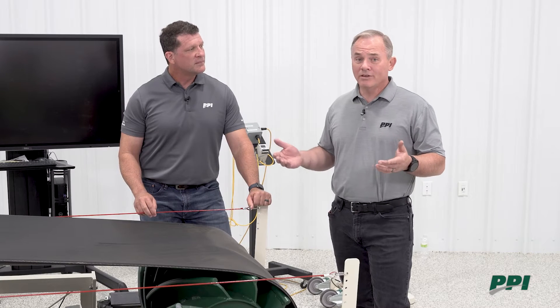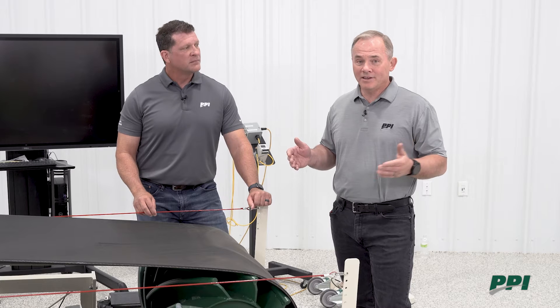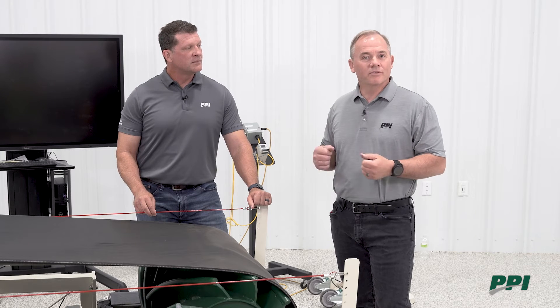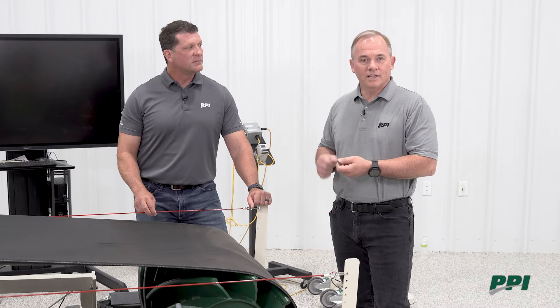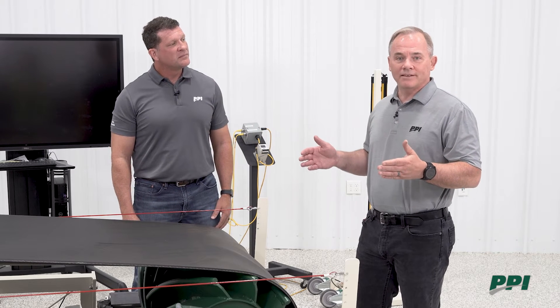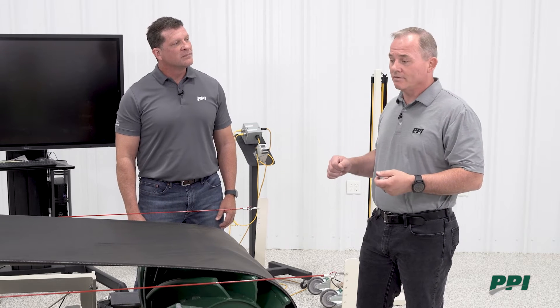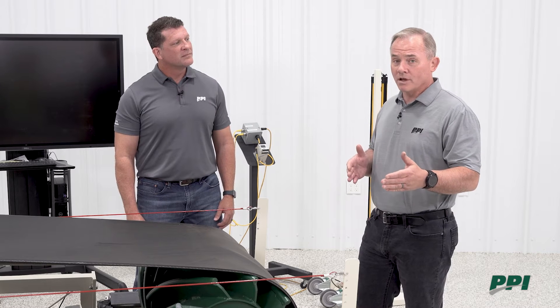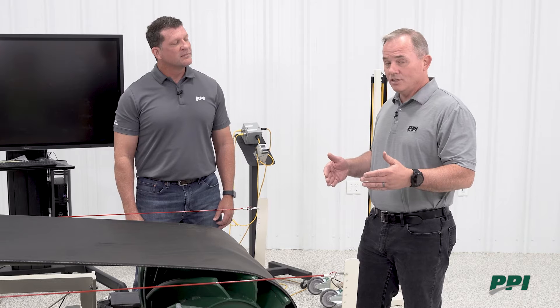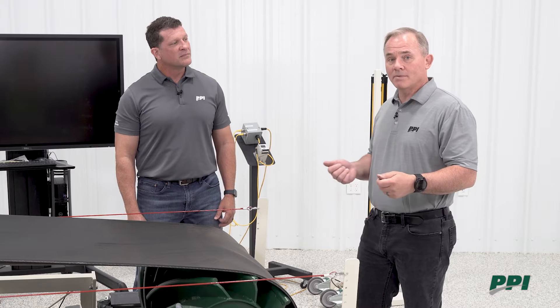One is it's easy to do. Compared to other methods of belt tracking, it's very convenient to just come around to the back of the pulley, grab your wrench, throw it on the screws, and do some turns. One of the most primary reasons is because it's effective — when you skew the pulley you can have immediate results, and you can literally overcome other tracking issues by putting enough tension in the belt and skewing the pulley enough to forcibly make the belt come back to the center.